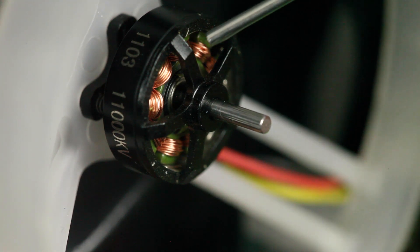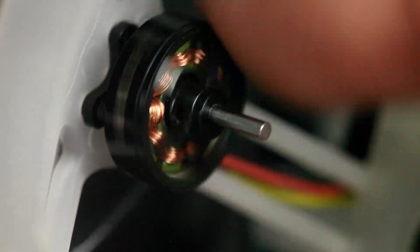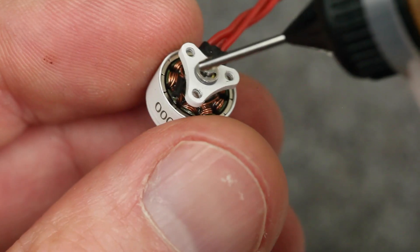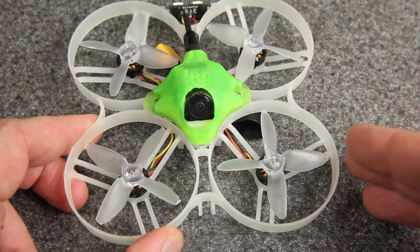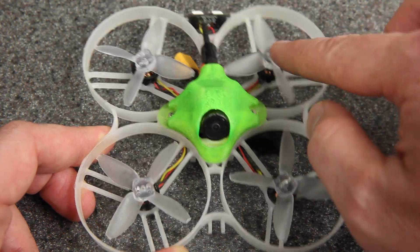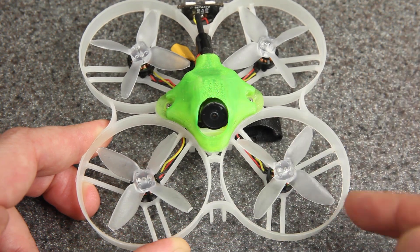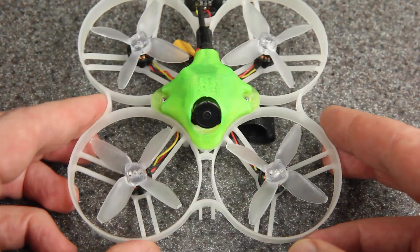Once the needle is in position along the shaft, tip it down or squeeze it a tiny bit and you can usually see the oil lick its way around the rest of the circle. You can do exactly the same thing with smaller motors — just come in through the hole to that center shaft, apply a little bit of oil, work it into place, and then if you want to get the clip on the back, just the tiniest drop is all you need. Once you've got the oil on there you're really done, but I recommend turning the motor several times to help work the oil down the shaft. Then when you arm, let it idle for several seconds because that low RPM spinning helps work the oil around. If you go immediately to really high RPMs, it may just splatter out more than necessary.